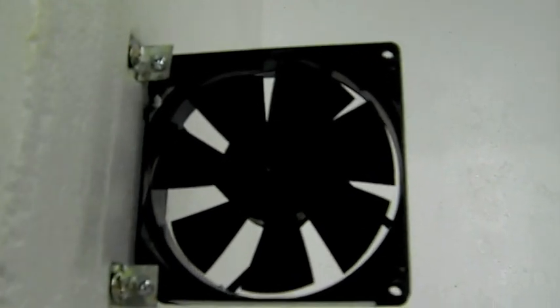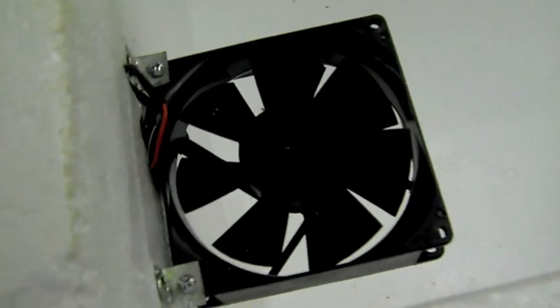Screw that into the incubator, then drill a hole, put the cables out, and mount it to the adapter. We've put the fan in — screwed it on with a bracket and put the cables outside. Next step is to put the lamp kit on and make a bracket for it so it doesn't melt the plastic. We remounted the fan with a change of plan — instead of bringing the fan cables outside, we decided to wire it in and tuck it down to make it look neater. Now we're going to test it — we have power to the fan.